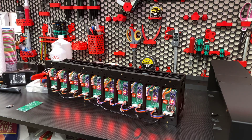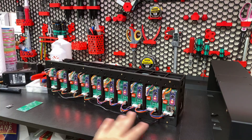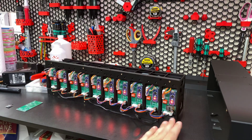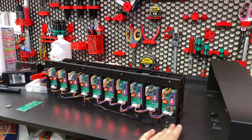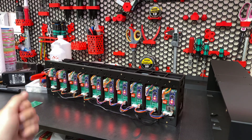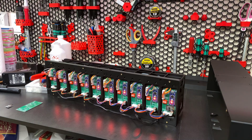Power comes in here, daisy chains down the I2C, the ESP translates what you want to display and sends a character to each one of the IDs. That's pretty much it. Now I'm going to jump into some tricks, tips, and issues I had with building this unit.